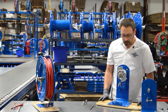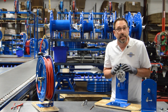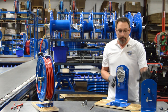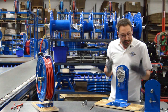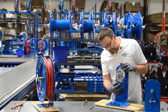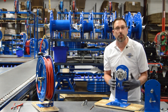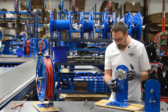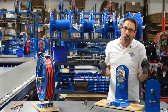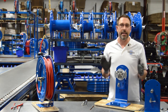I'll demo on the T-Series first. The T-Series is actually easier to do because this bracket is smaller, so you have a lot more room to work in here. The P-Series is a bit trickier because there's less room, but it's the same process. On this reel, you can't have anything in the way of where the pawl goes, so your disc has to be rotated such that you have room to work. If you're in a bad position, you need to either move the ball stop, pull the hose out, have someone hold it, or tie a knot in the hose — something to get it clear.